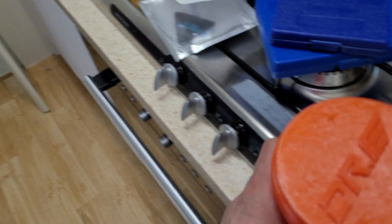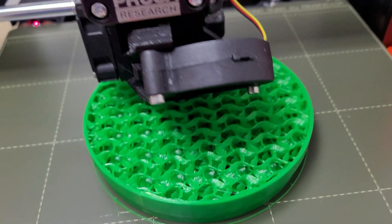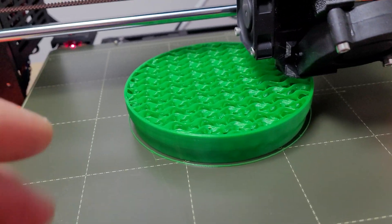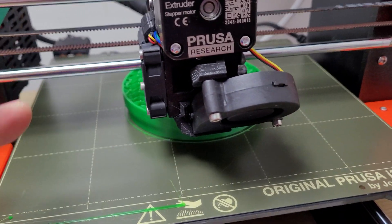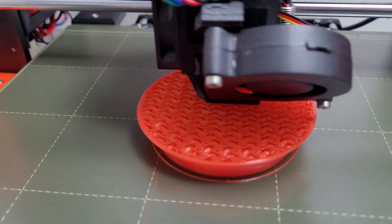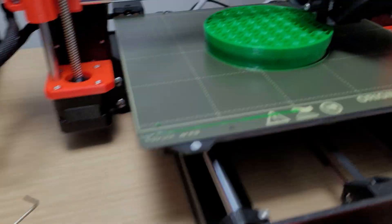Those are the two biggest factors. Let's take a look at some of these gyroids I'm printing out. This is a pretty big gyroid at around 8% infill. A gyroid will also give you more contact points to the surface — if you do this with honeycomb, you're going to get much bigger holes. So you cover more of the surface area with the gyroid pattern. This other one I'm printing is at about 20%. Gyroid pattern can be very useful.